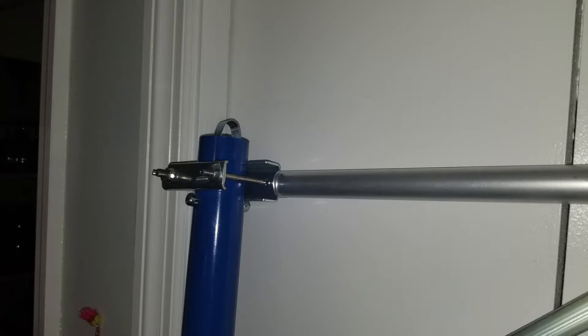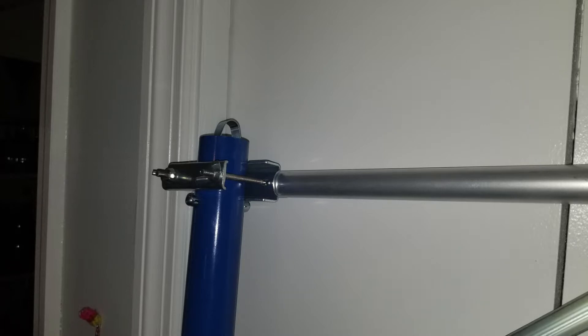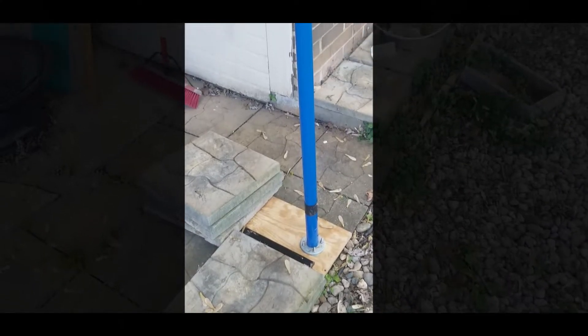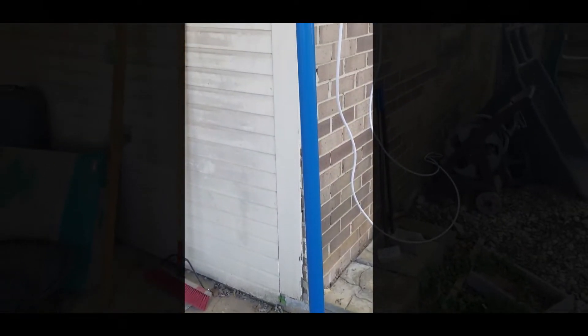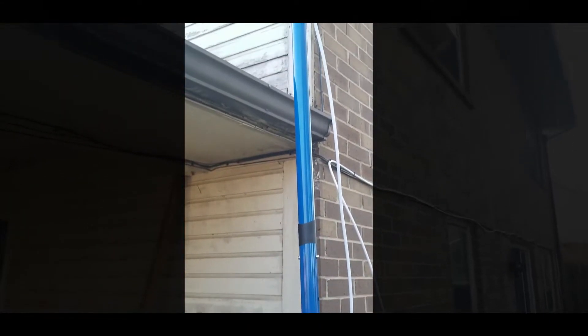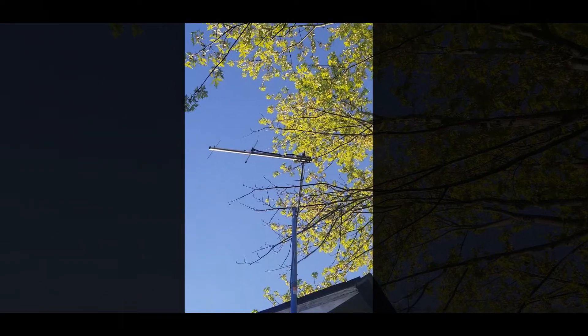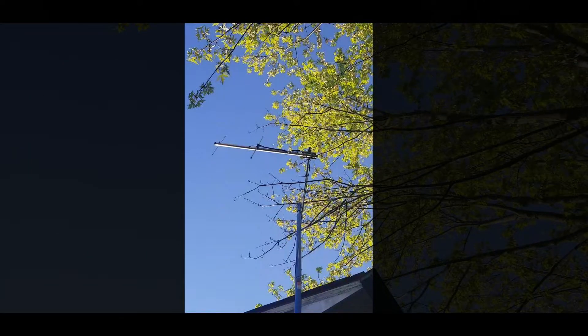I bought a standoff arm so that the Yagi will be away from the metal pole. I've got this thing set up, as you can see here, and put some rubber on the arm so it can grip a little better with the brackets. I've got a few snippets here where I switch between listening with the Yagi — which is pretty copyable — and then I'll briefly switch over to the J-pole, and the signal just about completely disappears. We'll let you listen to a few of these snips.